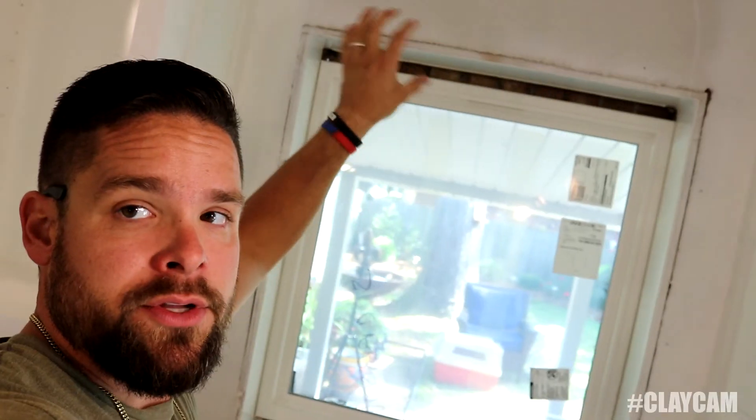The brick being on top without a lintel really made the situation just a little bit tricky, but all we did was just let the brick sort of rest on top of the window. It's only one course — it's not even really one course, it's just a little square piece of brick. There's really no better treatment for this. What you end up with on the inside is a gap on the top and a gap on the bottom. All we need to do is put a little board here and a little board there and paint it quickly. Truth be told, this window went really easy because the window that was in there was a replacement window. Normally you have tabs going to the framing and it's a booger to get out. If you have any questions I didn't cover here, drop them in the comments below.